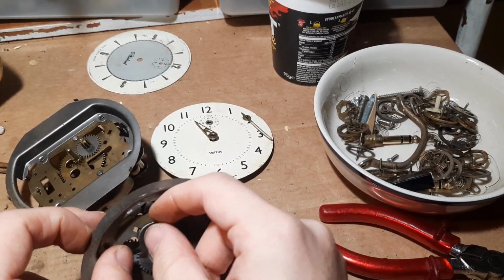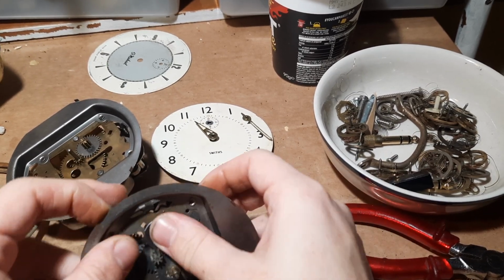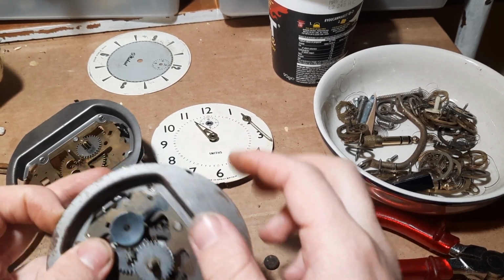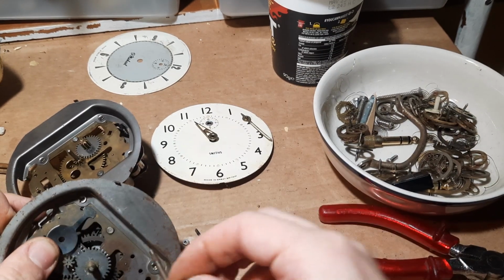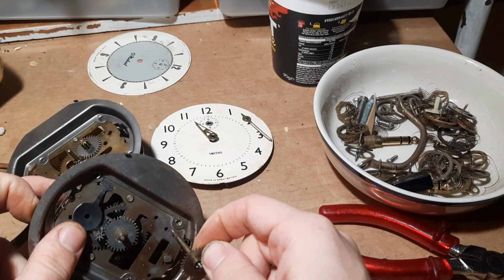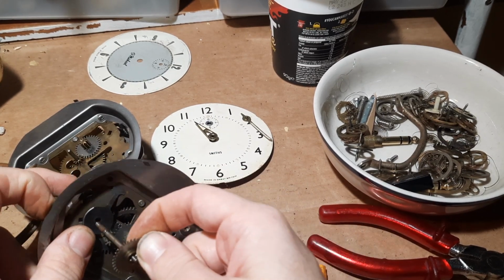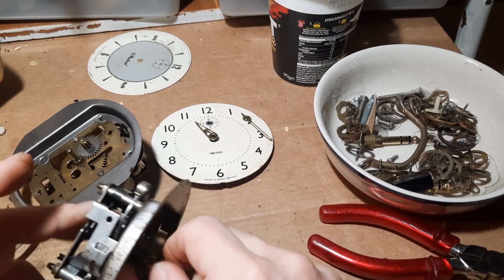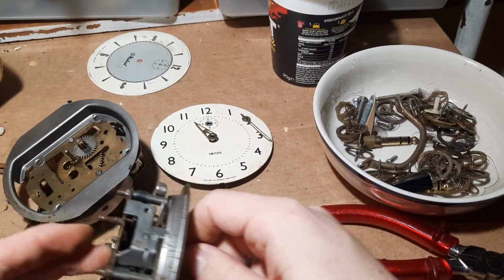And that fits over there with that little finger going through that rectangular hole. And these little holes down here are where, with the older designs, they didn't fully change the movement for some reason. These are artifacts of an older design, I think, where there was a different kind of spring that went up and around like that. It's riveted to there. A much older design for an alarm spring. But it's interesting that they kept that as a little artifact. So let's put that in there.